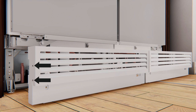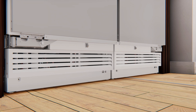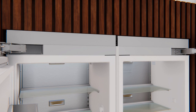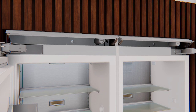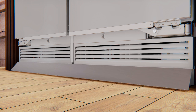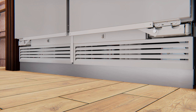Verify the two ¼-inch hex head screws assembled to the handle side of both the freezer and fresh food columns. Install the access cover onto the unit with two ¼-inch hex head screws. Install the front mullion trim between the two units — open the doors and push the flexible dart in the area between the units, ensuring the top dart of the mullion aligns with the bottom edge of the case trim. Open both enclosure doors to 90 degrees and snap the trim bracket between the water filter access enclosures above the displays. Install the toe kick by inserting it into the slot in the front access cover and sliding into place.